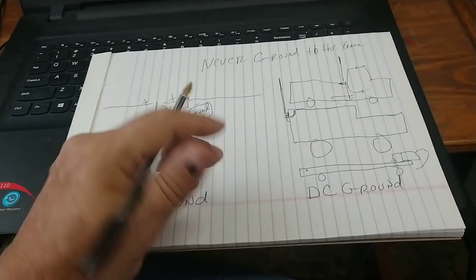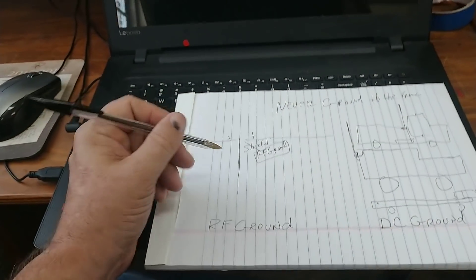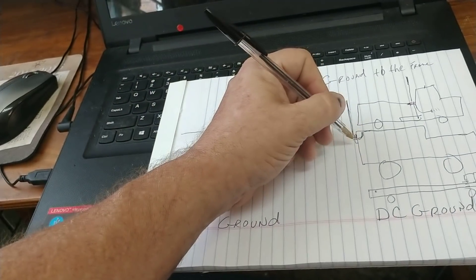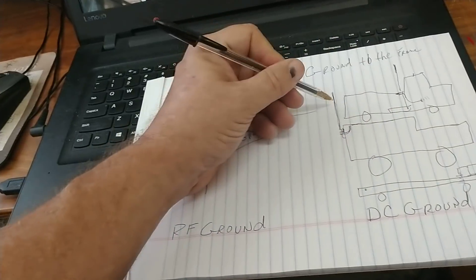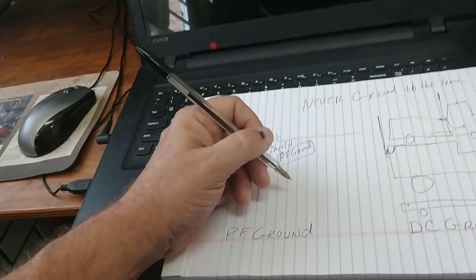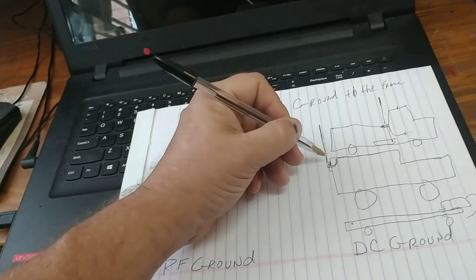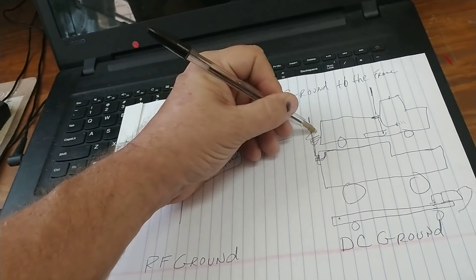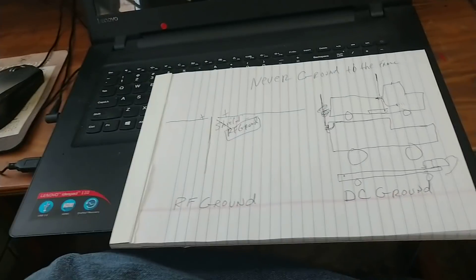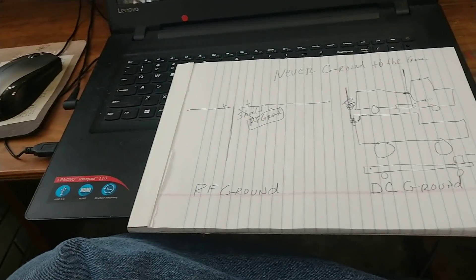Now, one reason I want to cover real quick — you get people that say, 'I'm grounded but my SWRs just won't go flat.' If you have proper RF grounding, if it is grounded perfectly and you've created a sufficient counterpoise for your antenna to work off of, your antenna will have a one-to-one SWR somewhere. It will be resonant somewhere. Say you've got a brand new Predator 10K — Predator sends you an extra long stinger, the whip that goes inside the top. It's extra long because you're going to have to trim that.